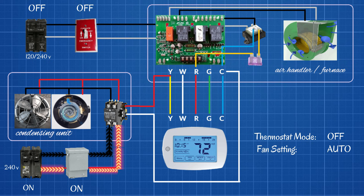Now we're going to move on to turning on the breaker for our furnace or our air handler. If you have a furnace, this is going to probably be a 120-volt single-pole breaker, probably 15 amps, possibly 20. For air handlers, it could be 120, but most likely these days it's going to be a 240-volt two-pole breaker. But either way, let's go ahead and turn that on.